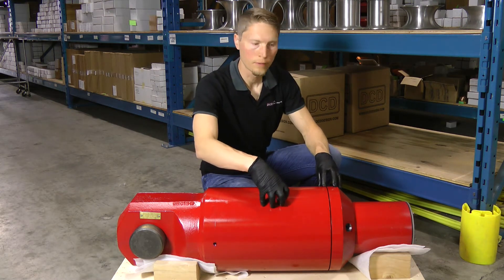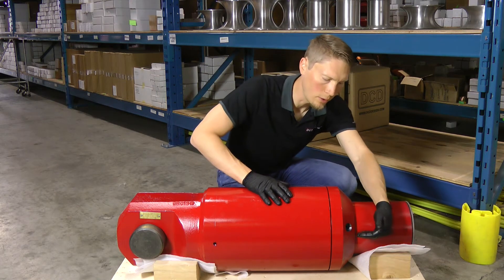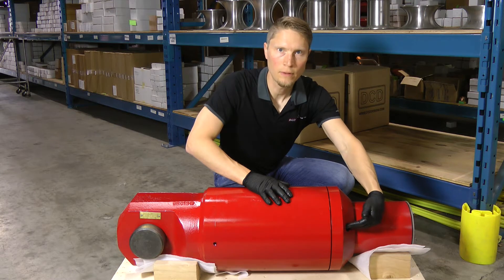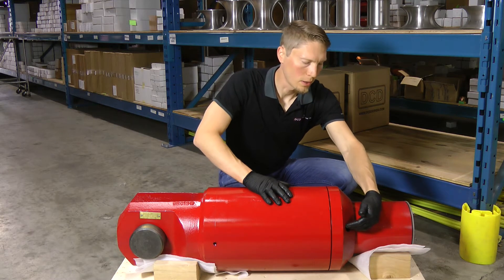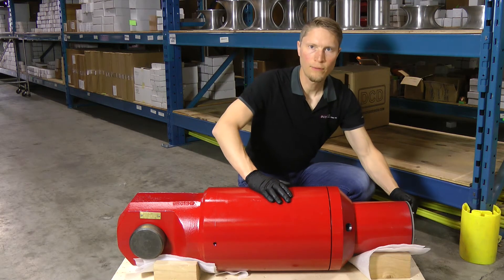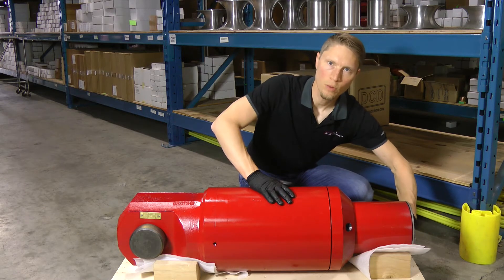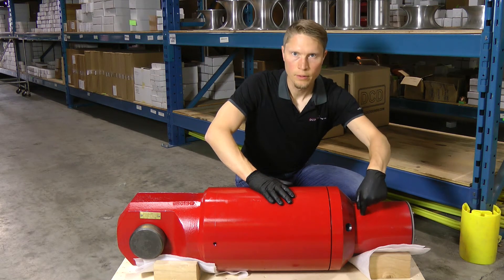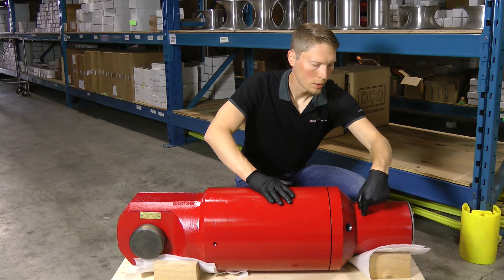So these holes we're going to leave. For this example, what we want to focus on now is the relief valve, which would be mounted on the side of the seal cover, covered under a pipe plug. If you have an older revision, your relief valve could be in the center of the box end, and you will have a viewing port on the side here.